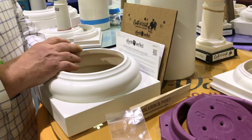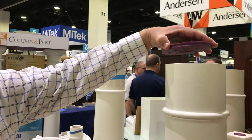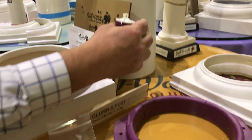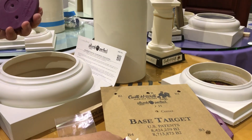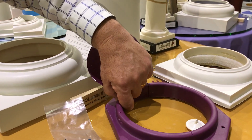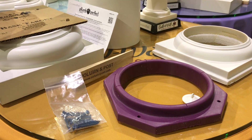When the customer gets ready to install it, they locate the top of their column with the header puck, then drop the plumb bob down onto the target. They find plumb, mark around it, and that becomes the home for the base ring. The base ring itself holds the column in place.